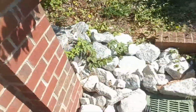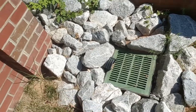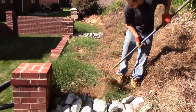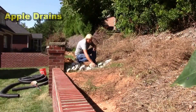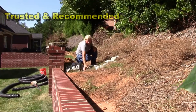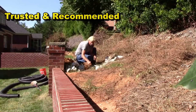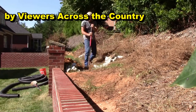So we're going to start at the end of his yard back there where that area is really eroded — gravel perforated pipe, pull up this riprap. They've got a real nice 18 by 18 storm drain we're going to tie right into. First, we've got to pull back some of this straw and move some of that riprap and stone so we can dig through there. This retaining wall already has a great footer drain at the bottom. There's no cracking or movement of the wall, however when it rains hard, because the neighbors above — the subdivision above — all drains this direction, the water just pours across and over the wall.